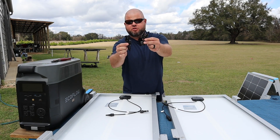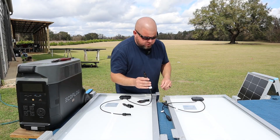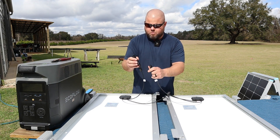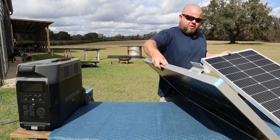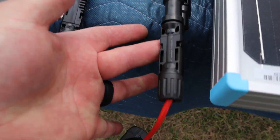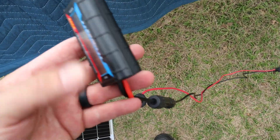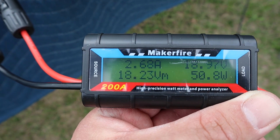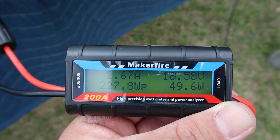What I've purchased here are called Y-branch connectors. As you can see they'll accept two cables in and one cable out — they have a combiner built right into them. So I take the two labeled positives and hook up, then I take the two negatives — we've just paralleled the system and increased our amperage but kept our voltage the same. Both positives from each panel come to the Y-branch connector making one positive, both negatives Y-branch together coming out one negative. We're heading right back towards 20 volts — that did not change. Our amperage is quite a bit higher but voltage did not change. That never does whenever you parallel.